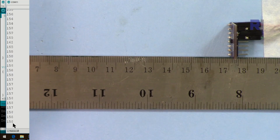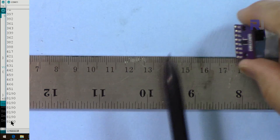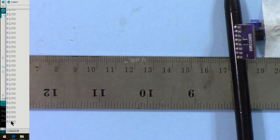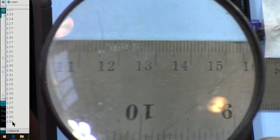At 170 millimeters we are getting about 5 millimeters of difference — around 166 readings. When I stopped moving it, the reading stabilized correctly. Now I'm pointing the sensor upward slightly toward the ceiling and we're getting incorrect values — showing 8,000 or 8 meters — which is an out-of-range error.